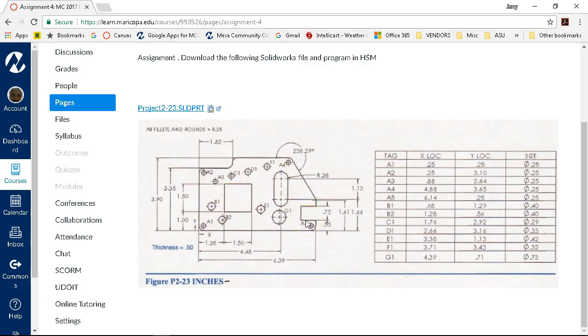Do we cut all the interior geometry first — which is always a risk — we drill all these holes while we have plenty of material to clamp onto, but then we run around the outside and something doesn't clean up. So we have to make sure that the stock is right. When we go through our workflow, the first decision is always the stock. I think this was a half-inch thickness. Is it already flat enough? Is it going to have any scratches or scores in it? What do we need to do for the tool library?